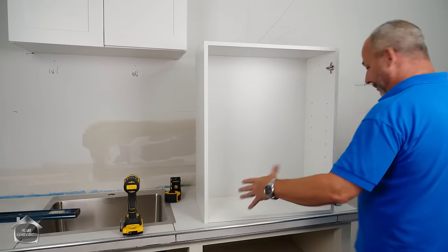Here's the best option. 1 1/8 with this positive stop. This particular screw can't go past the surface because of the way that head is made. It's a real beefy head on it, and it's not going any further. So when you're done screwing that one in, you have to be really careful because you can actually continue that screw to circle around, and it'll tear out all of the guts in the wall, and you'll actually lose its bond. So this one, you have to be really sensitive that you drive it just snug and then walk away.